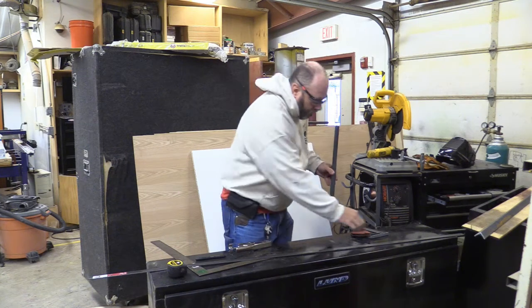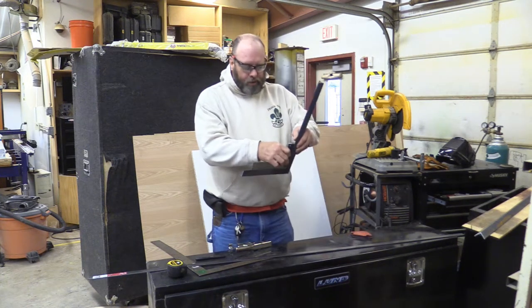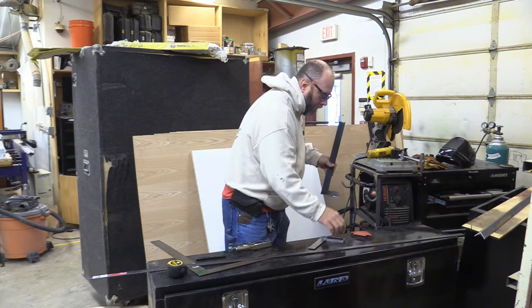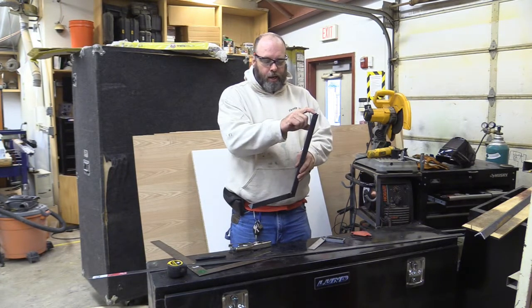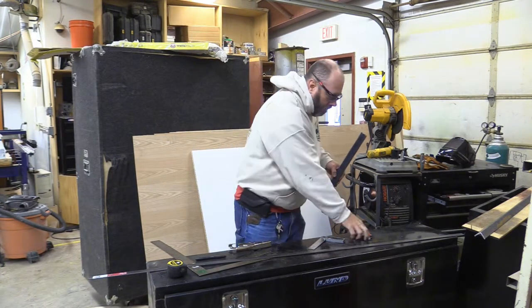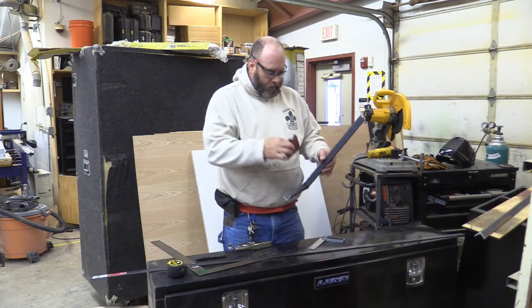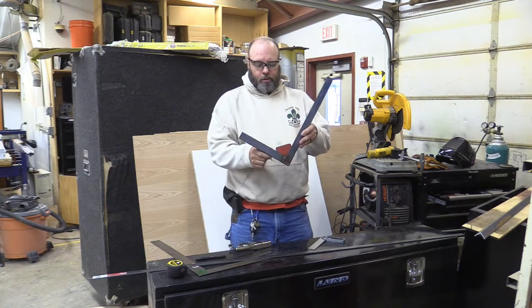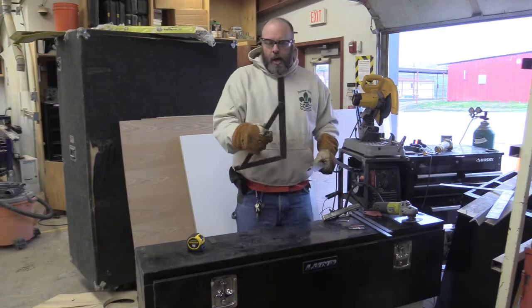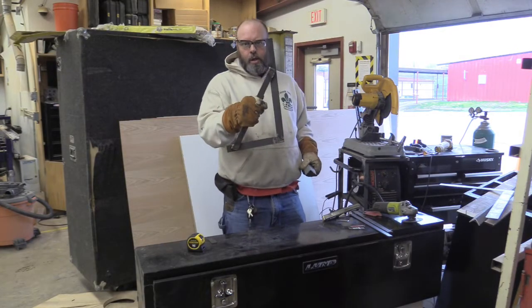The biggest thing you want to do is make sure everything's square as you're building it and that your sizes are correct. I actually had to add about an inch and a half because of the frame rail. The trick that saved me was one of these magnets to help keep it square, then I double-checked it with a traditional tri-square. There's our end bracket.